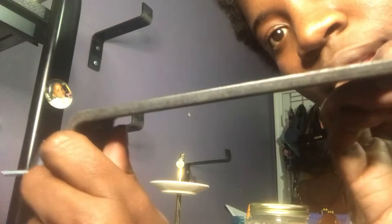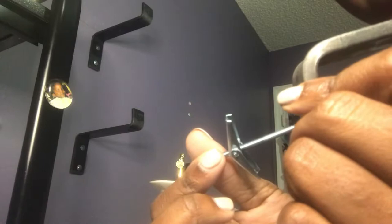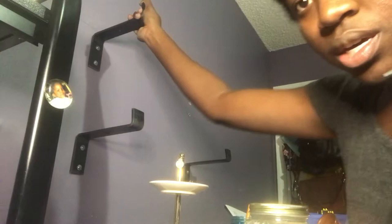So I'm going to use something called a toggle bolt. You can get this at Home Depot or wherever. Basically you have a bolt that's two or three inches long, and it has this claw which clamps into the wall after you push it through a hole. Then you just twist and twist with a screwdriver after it's clamped into the wall. The rating on it is pretty good — you can tug on these shelves and see that they're not going anywhere.